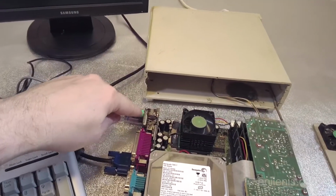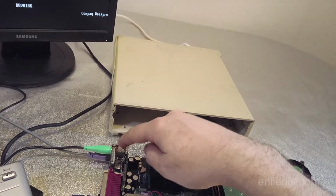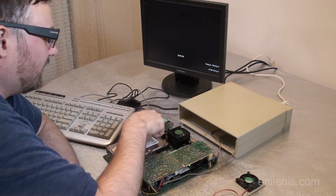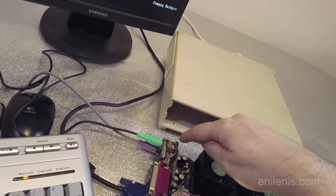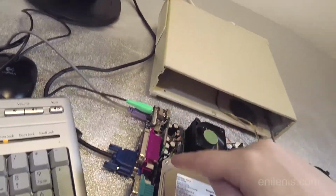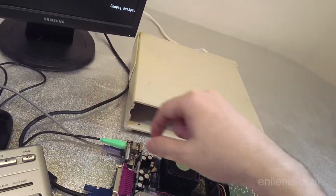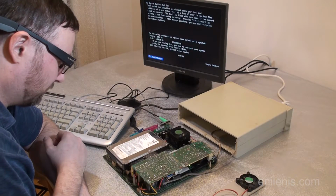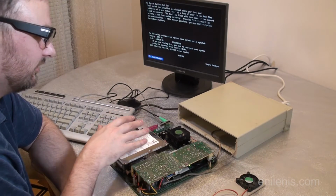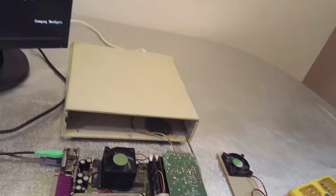Oh yeah, there's this one interesting plug that I mentioned earlier. What it does is interrupt one of the USB ports on the front. The reason I did that is to route some of the USB connectors to this board that I soldered to the PS2 connector. And this board is a wireless modem. It's a USB stick that used to go into the front USB, and I just decided that it would be nice to have internal network support. Again, even back in those days, wireless networking wasn't all that common. It wasn't standard. So having a feature like that made the box really unique.